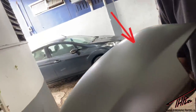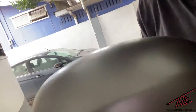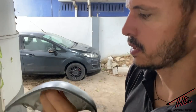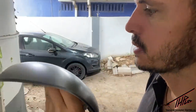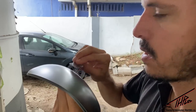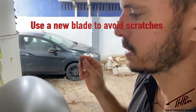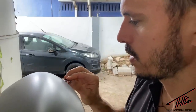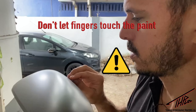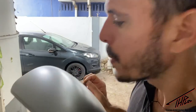Okay guys, I'm back. Parts are all good, looking good. What you've got to do is blow off any dust. If there's any dust in the paint from the paint gun, you want to look at the glare on the paint. If you do happen to see any little specks, you can take a blade and just scrape them off. Of course you want to do this when the paint is really dry — I let these parts sit overnight. Just cut it with a blade and blow it off.